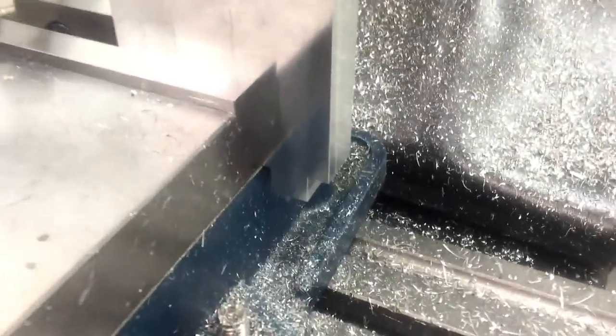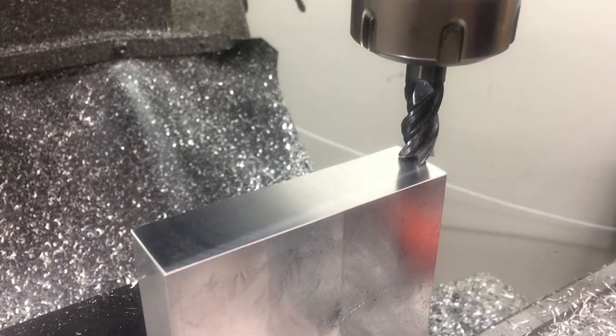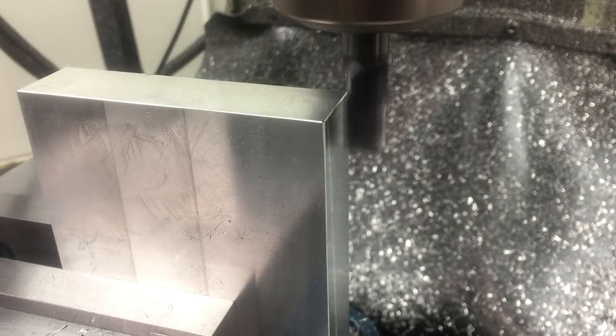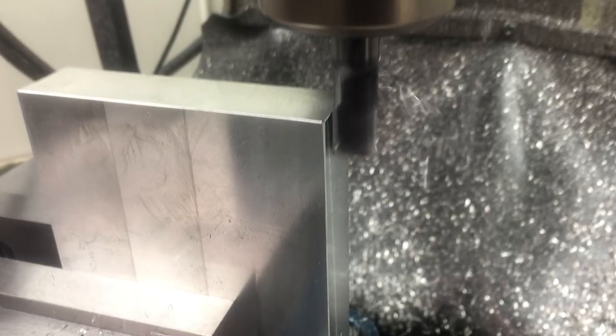When I set up on this side, I had to make sure the ear wasn't actually touching the casting on the vise, because the casting part of the vise isn't very square. This is basically a rinse and repeat of the other side with some slightly different dimensions.